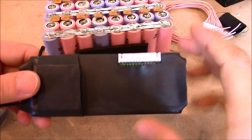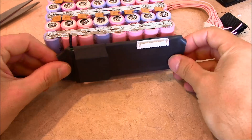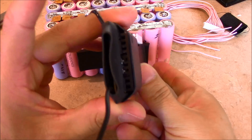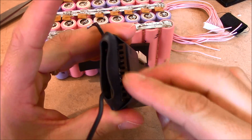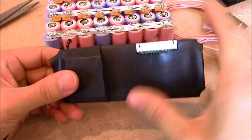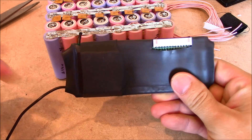All right guys, what I did was I didn't like this exposed area right here that was going to be sitting out. So what I did is I had an old heat sink from an old computer — I don't know if you guys can see that in there — and I basically just placed it inside there to give a gap and also some protection for the output transistors from something coming in and touching them, shorting out, or whatever.